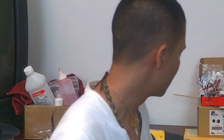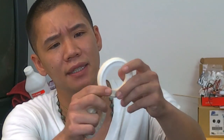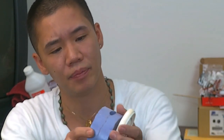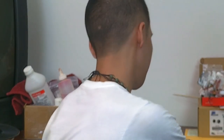For those of you that don't have access to a 3D printer, this is the urethane plastic I was talking about. It's a 2-part, 1-to-1 ratio. Hopefully I can make some molds. It's a very rigid plastic — it doesn't snap, it bends. What I did was make a rubber mold, put the mold together, and pour the urethane plastic in. It takes about a 10-minute cure time. This is actually the mold for this part here — it goes in like that. It's an ideal material for the plastic parts for the 3D printer.